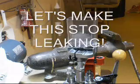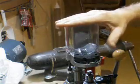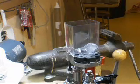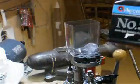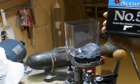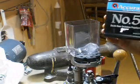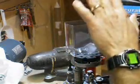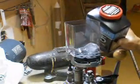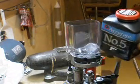The next thing I'm going to show you how to do is how to tighten the tolerance between your auto disc and the powder hopper. This is important for a couple of reasons. I found that when using Accurate number 5, I had a real problem with leakage on this, and I've heard of other people having leakage issues with this. I'm going to show you a trick that is unbelievable, and you're going to thank me. This is really cool, and it will make this 99.5% leak-free. I'm not talking about accidental spillages, which will happen to everybody, but this area will leak no longer.